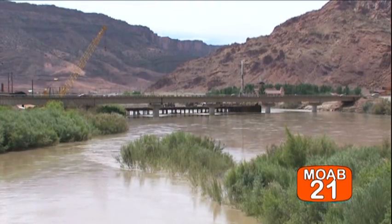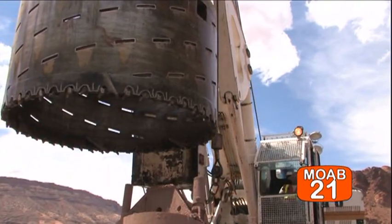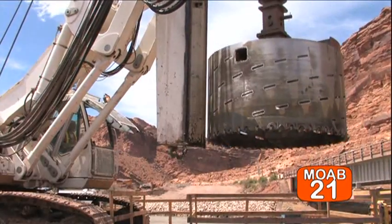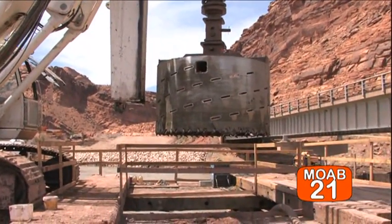There are several different types of ways that you can build a bridge across the river. What's really unique about this one is it's going to basically grow out of the water, a little bit like a tree. We'll start with drilling some holes down to get to bedrock. At this point we'll bring up some footings and then what's going to happen is we're going to do a thing called balanced cantilever construction.